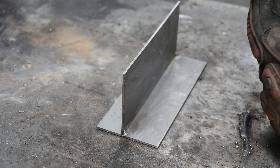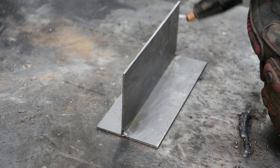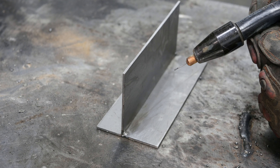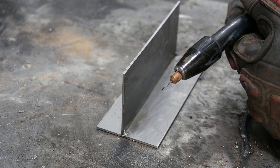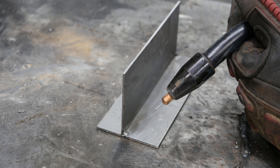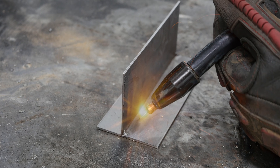Now, if you have a machine that only can weld flux-core and you want to weld some thinner material, things get a little trickier. We have some 16-gauge mild steel here. We've turned the machine down to 110 inches per minute at 15.2 volts. Remember, this wire has a very digging flux inside of it, which causes more penetration in the arc.